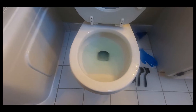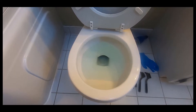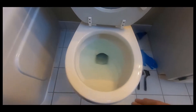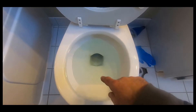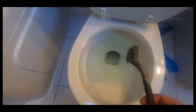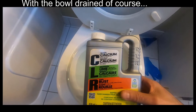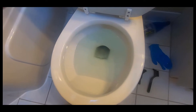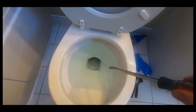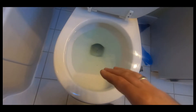Those solids and minerals adhere to the bottom of the bowl, and even if you clean the bowl once or twice a week, they still build up along the bottom. The buildup was so thick I tried using a wire brush to brush it off, and I even tried CLR because it dissolves calcium and lime — it did nothing. So what I had to do was chip it out along the bottom using my hand, sliding it along the porcelain bowl to flake the stuff off.